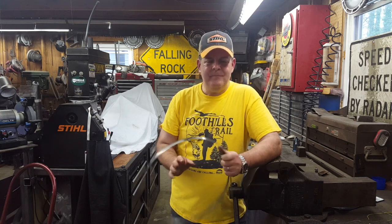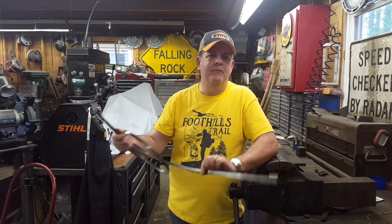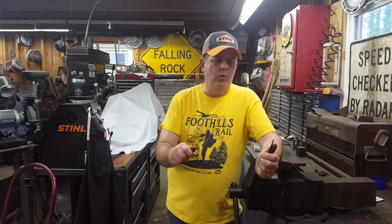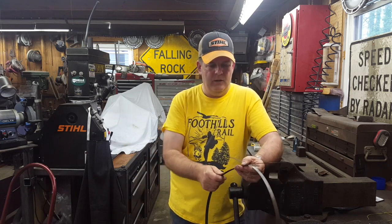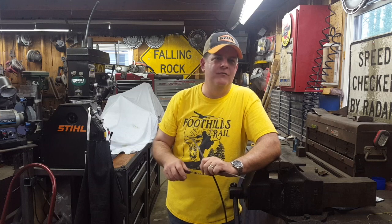Welcome back to the garage. In this video we're going to do a continuation of the preceding videos on the old Blackhawk bandsaw that we fixed up from Justin — his grandfather's old bandsaw. Anybody who uses a bandsaw much will know that probably the biggest problem you face is a broken blade. That was my big beef with the old Tammy bandsaw — it was breaking them. Even with the Blackhawk, if you're not careful, a drop that comes off can pinch and bind your blade and break it. That's what happened with my other saw — the drop came off, pinched the blade, and it popped right at the weld.